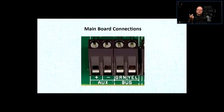A door contact involves something that's called a reed switch. If anybody plays clarinet or saxophone, the mouthpiece is connected to a reed, and the reed basically is two flat pieces of something that vibrate when you pass air through it. So it looks like a reed. So the switch looks like this. And when you bring a magnet close to it, they close. So that's why it's called a reed switch. The reed switch doesn't require power to operate. It just requires a magnet to be brought in close proximity in order for it to operate.